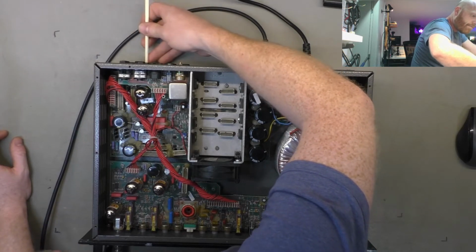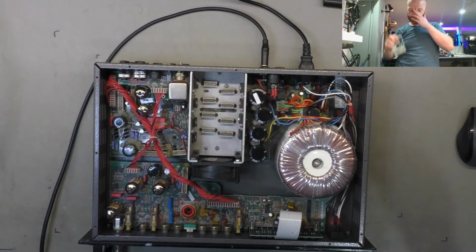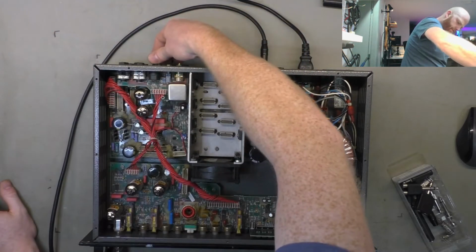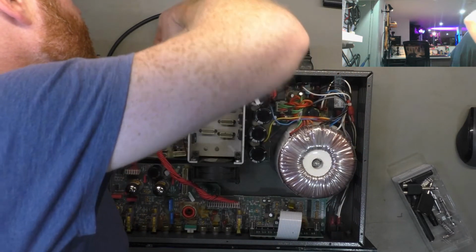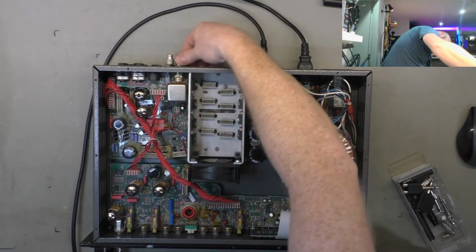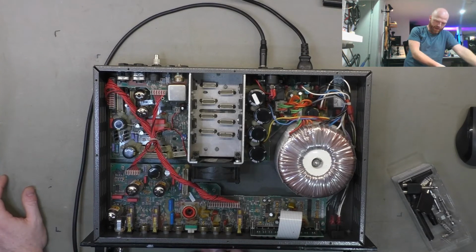That's your effects loop. Jack, disengaging when we plug something into it. Let's plug an actual jack into it. Plug, sorry. So I've just got one of these adapter things. Into the effects loop, doesn't completely isolate the signal, so it seems to be a parallel effects loop. We're actually getting fan noise when we do that.